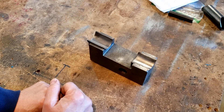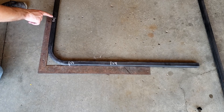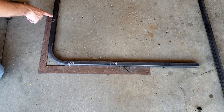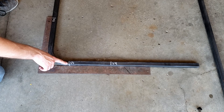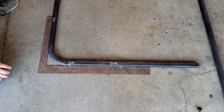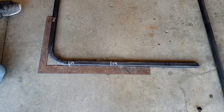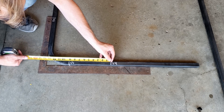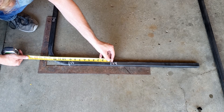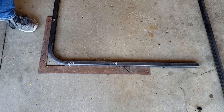We also have a Pro Tools die for inch-and-a-half and we made little spacers out of inch-and-a-half eighth-inch wall, welded up a base on it, and did the same for the other side — so that's two different ways we've made followers for our dies. To start calibrating, we made two reference marks from the end of the tube at 24 and 48 inches, and we estimated we needed to start our bend at 33 inches, so we put it in the bender at the zero point. We then bent it to 90 degrees and measured from 24 inches to the end of the bend — we came out at 14 inches.